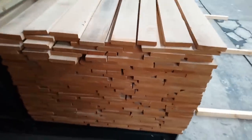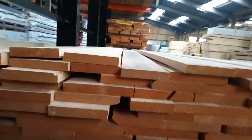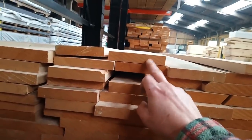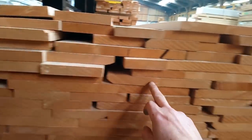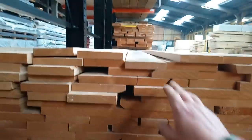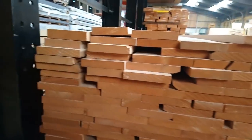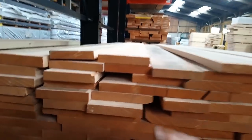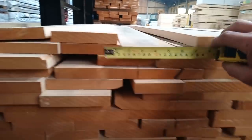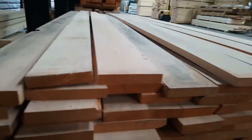This is my pack - they've only got 10 foot, not eight foot. You can see all these are just too small for me; I'd get 80mm out but I'd have quite a lot of waste. I need to see what I can get out of them - I'll probably end up going through the pack. These are 10 foot boards. I'll average them out at six inch wide, which means each one of these is a little bit less than half a cubic foot.